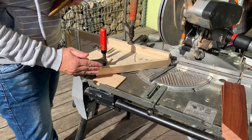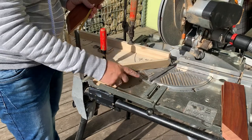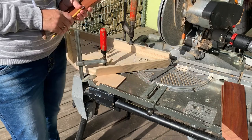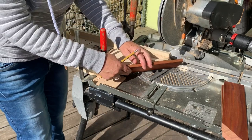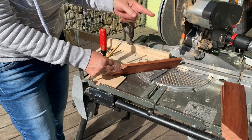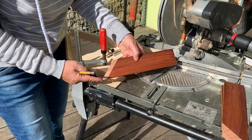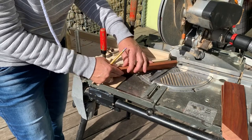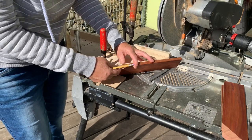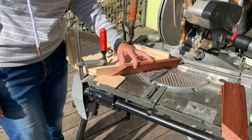We've now turned the saw to the other side, taken off the template, and clamped it back into position. We've gone again 15 degrees so that we've got an angle of 30 degrees. Then we can place our cut piece of wood back on and cut the other end. We clamp it in position so that our fingers don't get underneath the saw. What's important is that the longest piece of wood is at the bottom. Then we mark with a pencil where the wood is so that we can place the other pieces on exactly the same spot and get every piece measuring the same size.